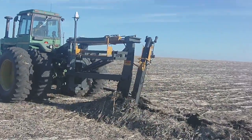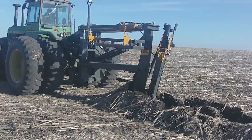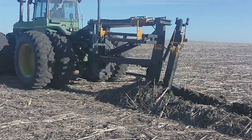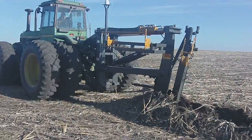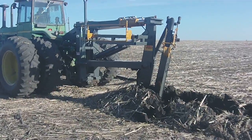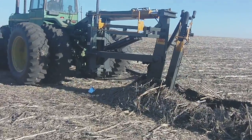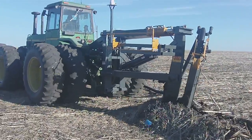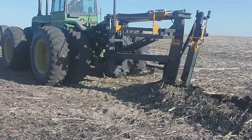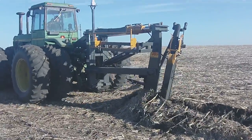If we ever wanted to add on to this tile, we'll know exactly where it is located and be able to add additional tile to the existing one in the soil. You can kind of tell just by looking at the soil that it's a little wetter than the rest of the farm. We just installed a line, and once we made the connection — the tile hadn't been installed for much more than 15 minutes — the tile was already full of water, doing its job getting the water out of the area. We anticipate next year we'll have much better productivity in those areas, so the cost of this tile is well worth the expense for the return on yield production.